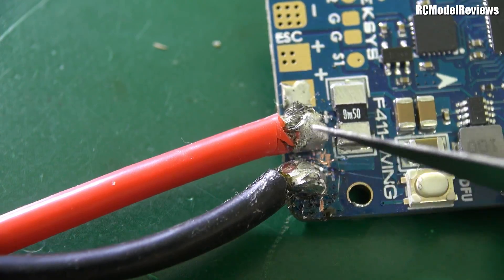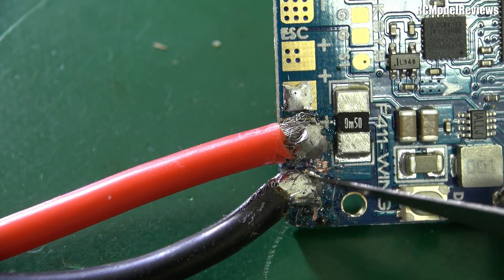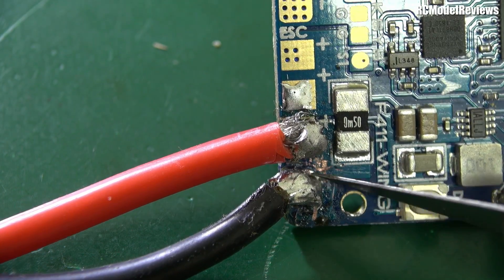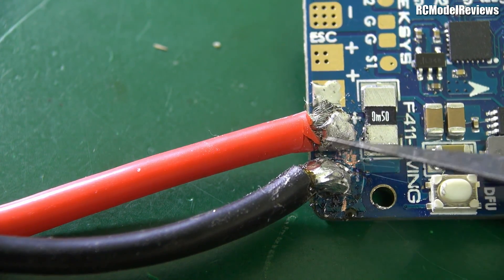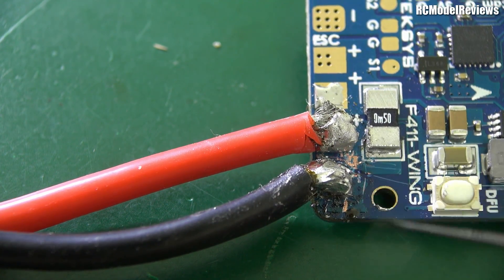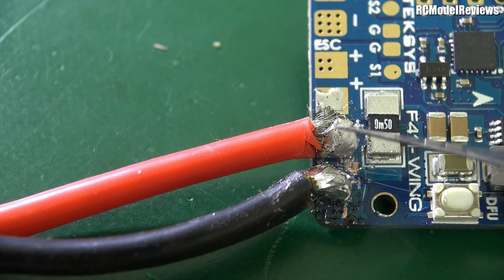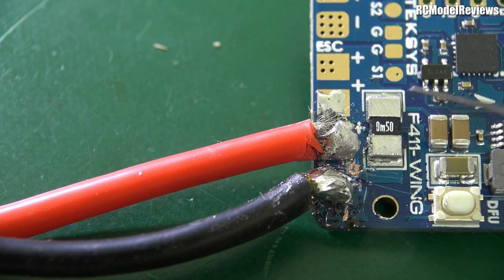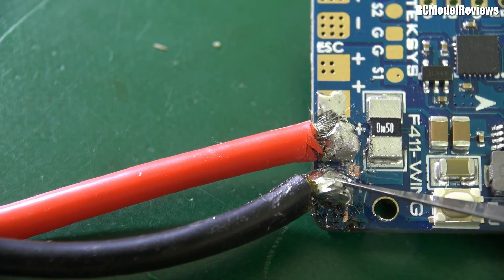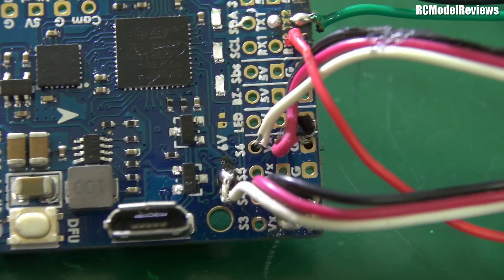On the other side, even these big areas here — this is quite an easy soldering job, but it's just not good. He's had to scratch away here because apparently the solder bridged. The reason solder bridges is because there's not enough flux — you've used too much heat for too long, the flux is burnt out of the solder, and the solder becomes long and stringy and spiky. Instead of just balling up and making a nice shiny blob, when you pull your iron away it pulls away a whisker, and that whisker can go across and join two bits together instead of being nice and separate.